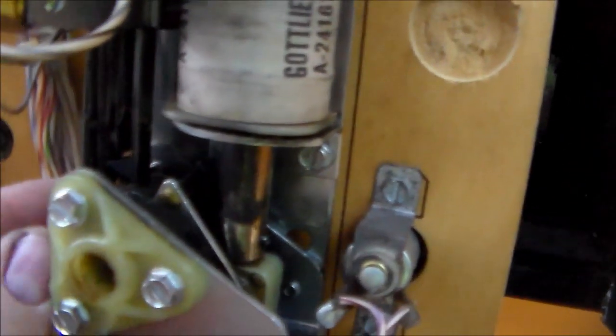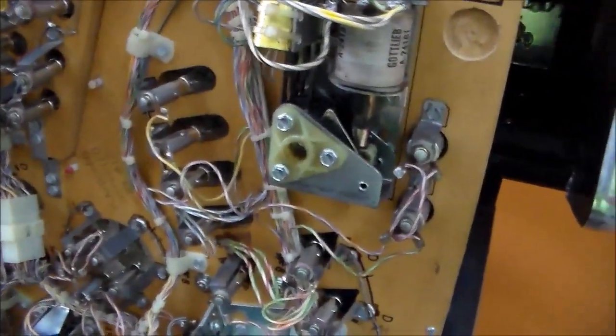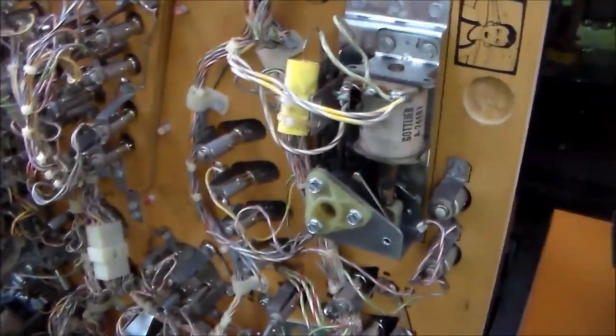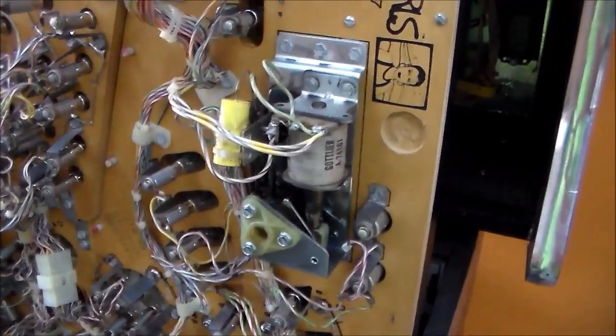And basically, when you take the shaft of the flipper out, this pawl is just sitting in there, and there's a spring on it. So I think if you look, see how basically the pawl is making both of the switches touch each other? So you're sending your solenoid voltage into your switch voltage. So yeah, we got problems on the switch matrix. So I'm going to look specifically at that lane change switch, see how it goes into the board, and try to track that down and see what that would have fried.